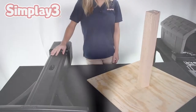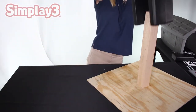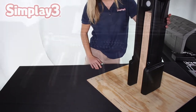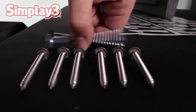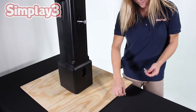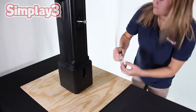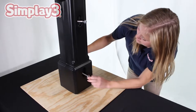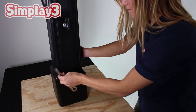To secure the base into the post, simply slide the base of the unit onto the above ground section. Note that the panel side of the base will be on the right-hand side of the unit when it is facing the street. With the base properly fixed over the post, secure the unit in place with the two large self-tapping screws fed through the two metal washers. Secure both positions along the post into place using a socket wrench.